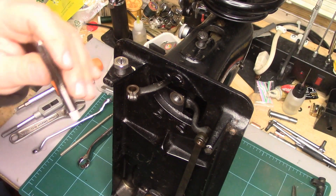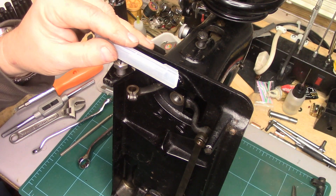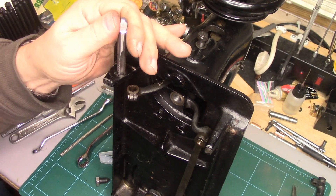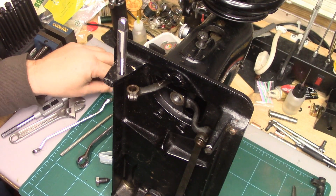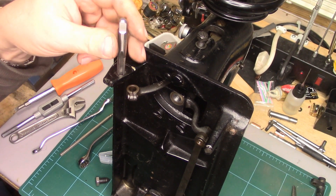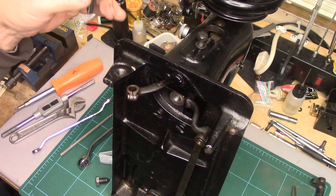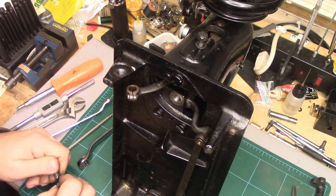I know I can fix her problem — she didn't go that far in. But read this as a warning: these are different threads at these two points. I also own a 3/8 by 28 tap which, as you'll see, fits here perfectly. This tap is a bit expensive — these are like eight bucks a piece, you can get the set of three for under $30, but this one tap in particular is $30. I also bought a 3/8 by 27 thread-per-inch tap — also $30 — and a 3/8 by 32 threads-per-inch tap, which oddly enough was pretty cheap, like under $8.